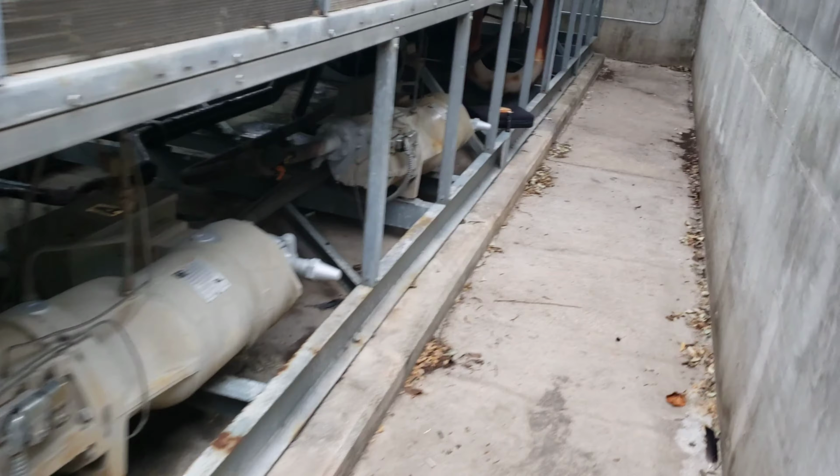So all of that's leading me back to our unloader here. We're about to troubleshoot this and see what's going on. You see a little bit of a leakage there. But anyway, there it goes. Let's see what it says. Yep, it's already up there. This shouldn't do it that fast. RLA is 165.